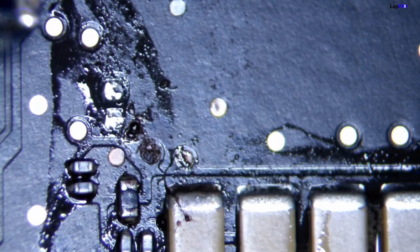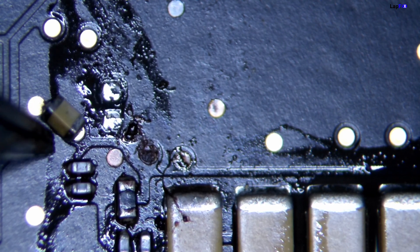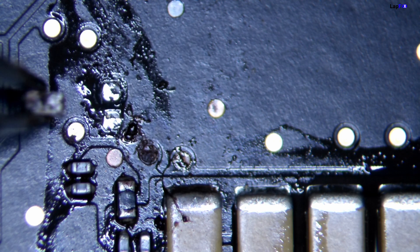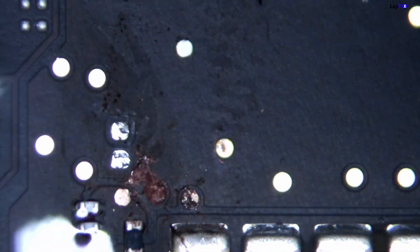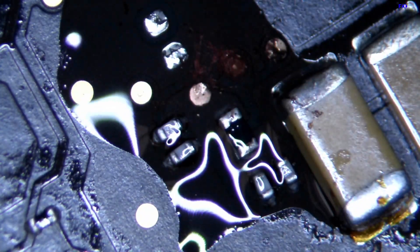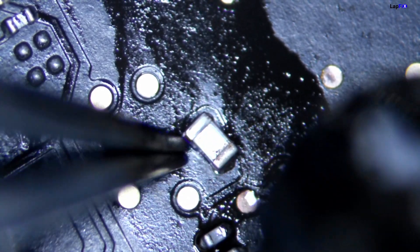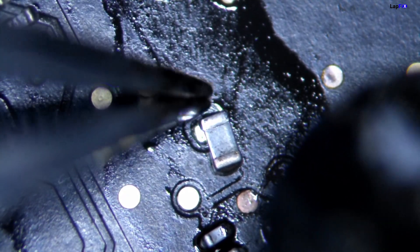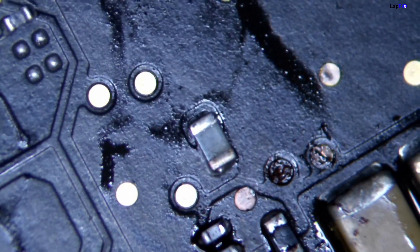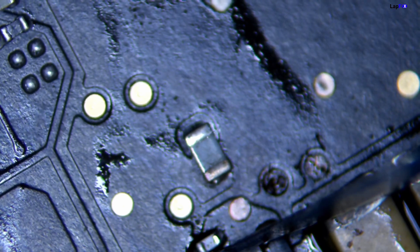We're going to do our cleaning — put some flux and make sure this whole area is nice and clean, because we don't want any stickiness touching it when we put a brand new cap on there. You can see the damage when you flip it over — there are black spots on the bottom where it makes connection. We need to make sure the connection is totally clean with no goop, so we won't short out again. We're going to replace it with another C6902.